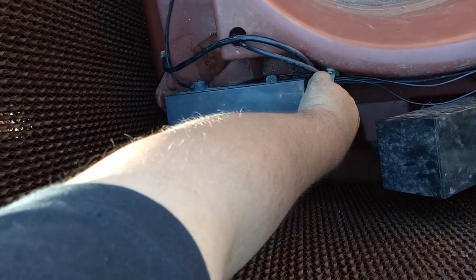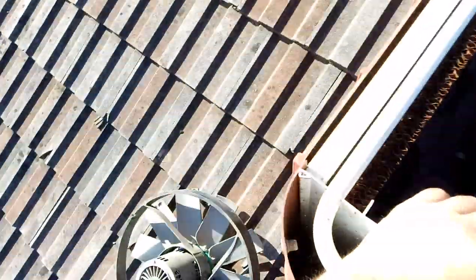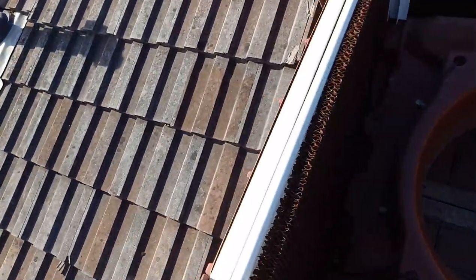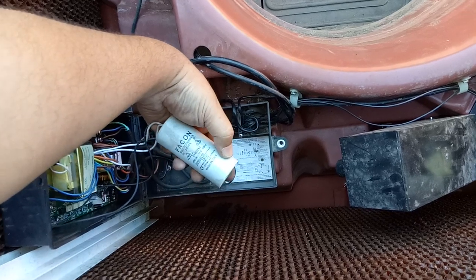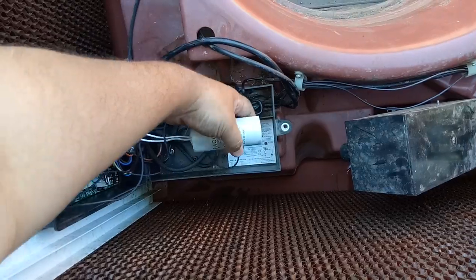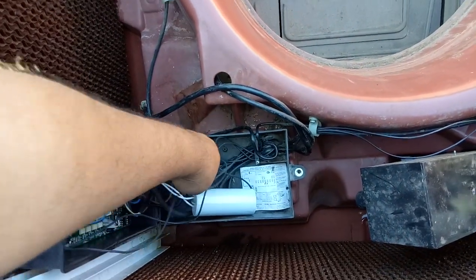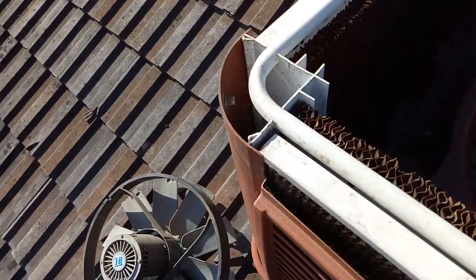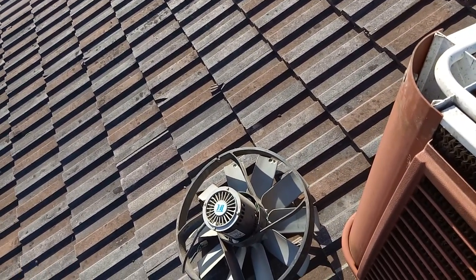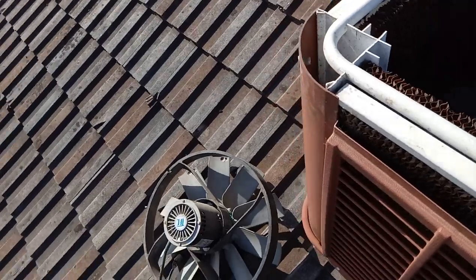I know what the problem is and I'll show you that in a minute. Make sure you turn it off and test it — test that it's dead. This model has a plug under the tiles; you could also unplug it and that way you know you're safe. In there is a capacitor — this one is a 25 microfarad and 450 volt, which sounds about right for the size of motor. And there are all your motor connections. The problem is it was shutting down the safety switch every few minutes or every half hour, and today I smelt electrical burn and a lot of zapping — faulty motor, I thought.